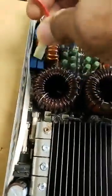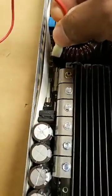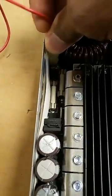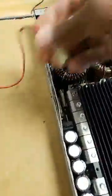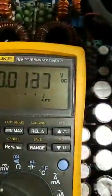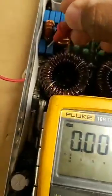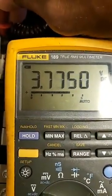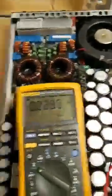All right, you saw that — a nice little flash of fire. So we're going to do the same thing we just did to the negative lead, we're going to do it to the positive lead. There it goes. Okay, so I just discharged the negative and positive. Always exercising safety first — even though we did that, we're still going to measure again. We were at 163 volts negative — going back on that negative terminal, now it's at negative 4 volts.